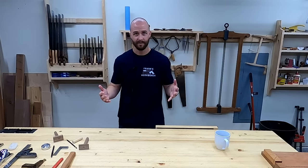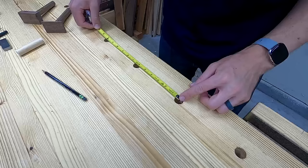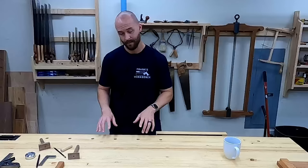What's the problem with the tail vise? You have to potentially turn the screw to span the full distance between your bench dogs. Of course, you could just have your dog holes spaced closer together, but I don't like a ton of holes in my bench top. Mine are about six inches apart, and I wouldn't want to go any closer than that personally.